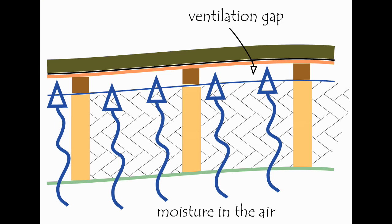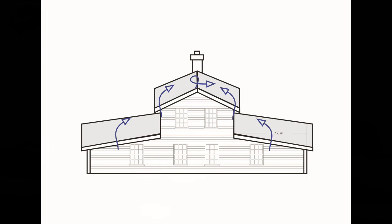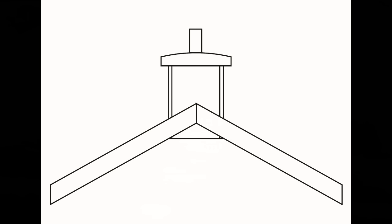So ventilation was designed into this house from the beginning. You can do all this with heat exchange fans these days, but we did ours the passive way. Moisture passes through the ceilings, through the insulation, and into the gap made by the spacers. From there it is drawn up through the walls and into the roof space, which is hollow and open. The moisture is then drawn up further and out of the building via the chimney, which is deliberately at the highest point. The chimney is a hollow box with ventilation holes, and it also contains the stove flue pipes.